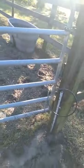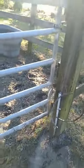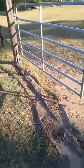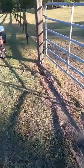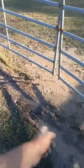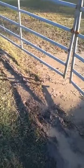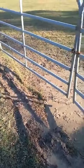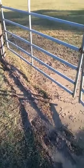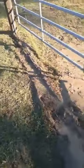Oh, and by the way, these are half-inch conduit metal EMT clamps, not PVC. The way I was doing them, they clamp pretty tight. So hopefully a lawnmower won't get it. Because if you run the wire up there without shielding on it, a lawnmower's going to get it, a weed eater's going to get it. This way, if it gets it, you know it before it gets to the electrical wire and shorts it out. Same way with it underground here. With PVC, you'll see the PVC before you see the bare wire. If you slack like I did up there and let somebody keep riding over with the tractor and see the PVC and don't do something about it, you wind up doing like I got to do later on and fix the underground wire. So, preventive maintenance is the way to go.